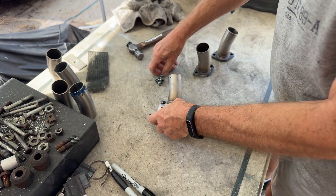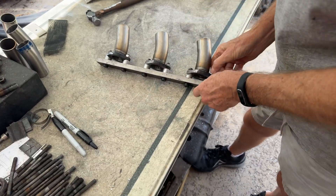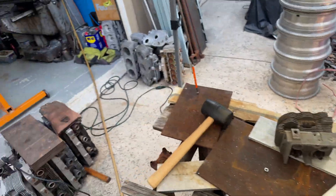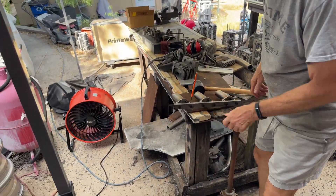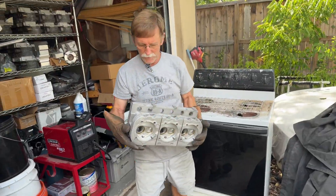These were in the freezer just to get them cold, but you've got to use the fixture to install them because it does it all at once. The only issue with freezing them is that they get condensation on them. So you've got to throw them back in the oven to get all the water off them — about 300 degrees.